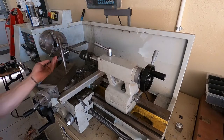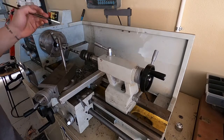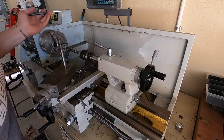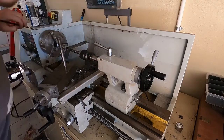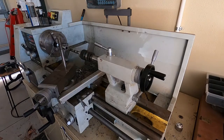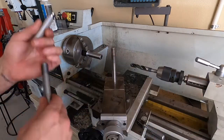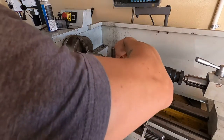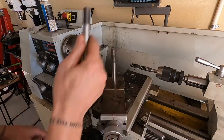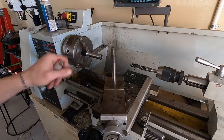It's getting quite a bit of pressure in there — the drill moved slightly in the chuck. The oil is just boiling off immediately, so I'm going to give it a couple of moments to cool down. While that's cooling, I should check to make sure this stud actually fits in there. And it does not. I might need to throw the boring bar through there on a really light cut to bring that down to size.